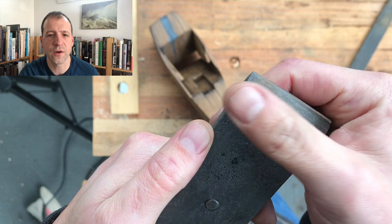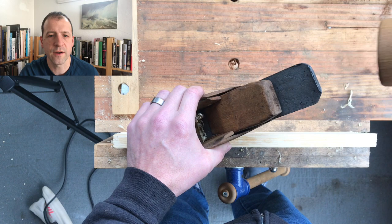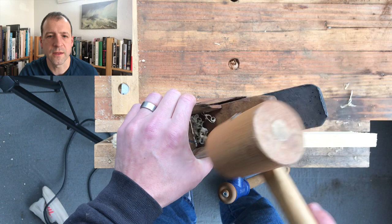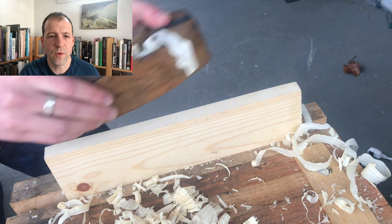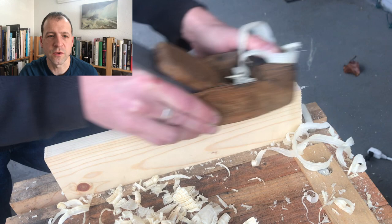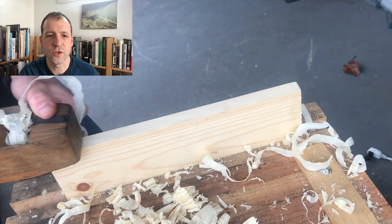I put the chip breaker on, giving it about a thirty-second of an inch — that gap between the chip breaker and the iron is the thickness of your shaving. Then I set the iron. It needs to go a little deeper. Surprisingly, we got it to work. But as I was planing, what was happening — though I didn't watch it occur — is that the cheek was splitting out again. The force from just using the plane popped open every place I'd tried to glue it, which I'm not really surprised by; it was a difficult thing to glue up.